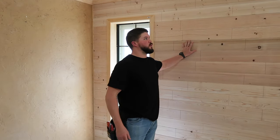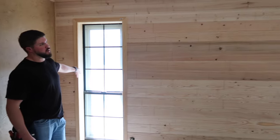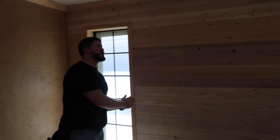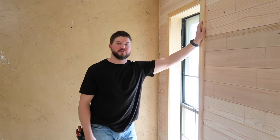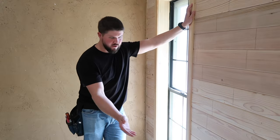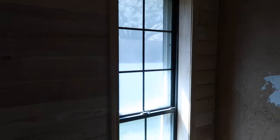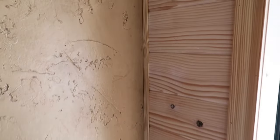So we finished the shiplap wall. We walked you through how to case out the windows — the insides and the casing part. It always makes it look a lot classier than just leaving it as sheetrock. This wall's completely finished. We did do crown on the top — if you're a first timer, you could definitely do crown, but I would recommend just running your shiplap all the way up the wall and capping it if you're not going to run crown, because crown can be tricky. It's not 90 degrees. We showed you how to do the casing, put all the baseboards back on, and got those little cut lines throughout. On the ends, we did tiny little trim pieces — remember how we showed you your cuts won't be exactly even? We just put this tiny little trim piece down and it made it look super clean, because this will be painted and distressed. Once all that's done, it'll look like a clean, brand new wall. I hope it helped — like and subscribe, we appreciate it.